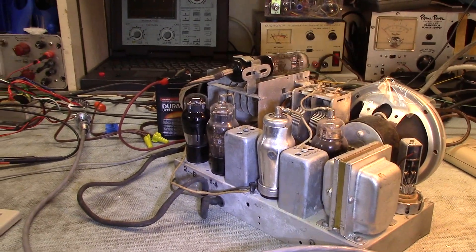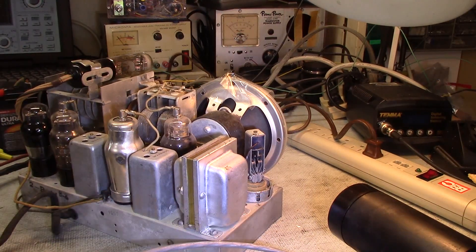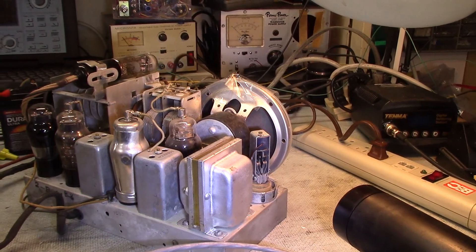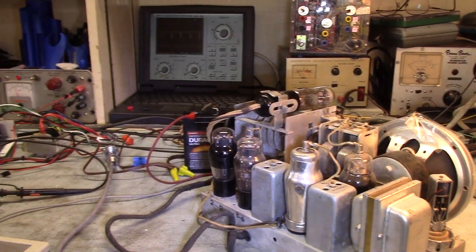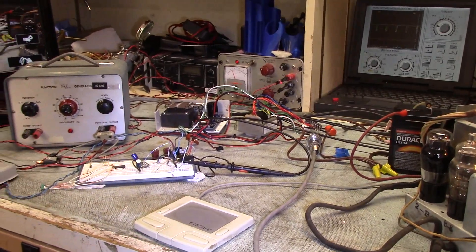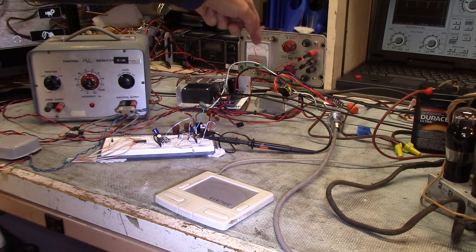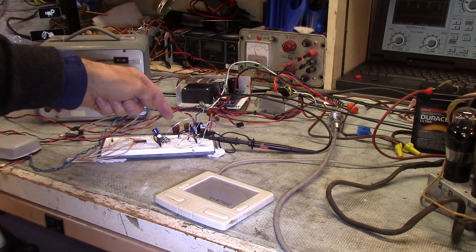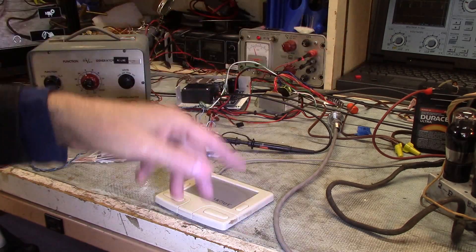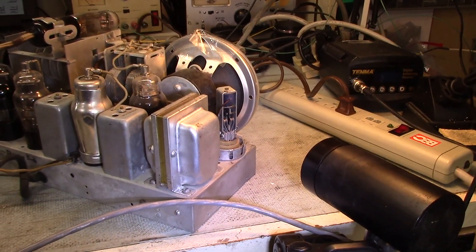The radio could run just like it would on a wall outlet, but running on DC. What I've rigged up here is a strobe that I salvaged out of a high-speed balancing machine — the strobe was part of the balancing mechanism. It had a 600-volt power supply, a 12-volt power supply, and other bits and pieces. I rigged up a little trigger circuit with a transistor and a FET to trigger the SCR that's in the strobe itself, which is in this can here pointing at the vibrator. A bit of an electrocution special, I suppose.